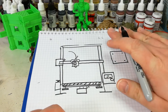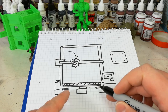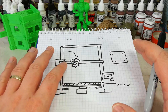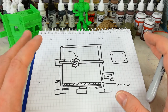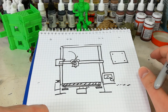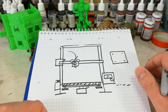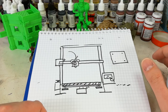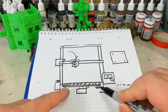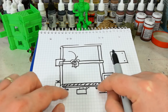In this top-down diagram, the heat plate has these little adjuster knobs where you can adjust the four corners and make sure that your bed is level when the head is moving around on it. This is important because obviously it needs to be flat — it doesn't understand whether or not it's flat, it can't calibrate that for you. There are add-ons that you can build or add to it yourself that will automatically level the bed, but you're going to want to do this manually the first time so that you get the gist of how that works. Simply screw these knobs up and down; there's a spring underneath that adjusts how the bed sits on the heat plate.